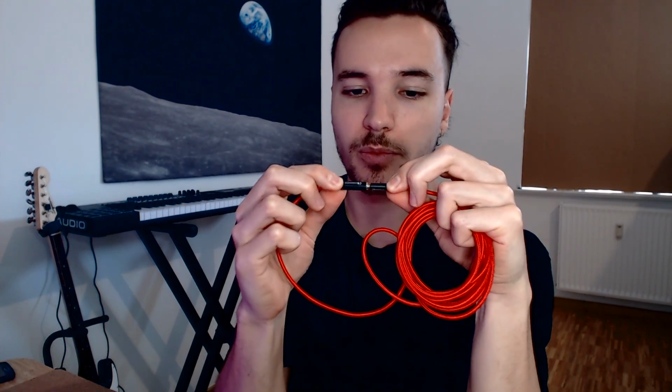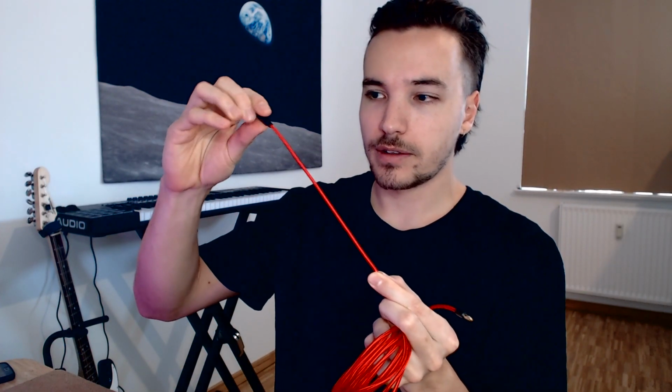I was going to buy a solderable version of that and then buy some cable and solder that onto the cable, but then I realized that if I need a male and a female to plug into each other, then I can just buy something like this, which is a headphone extension cable, and it already has a male and female that plug into each other. So all I have to do here is have this as my cable going to the headphones and cut this end off. So this is just the connector end, and have this soldered onto the end of that, right? So that's just a small section, and then the other section, which has this on the end, will plug into that, and then the open end will plug into the headphones.